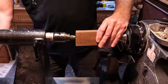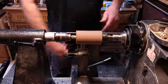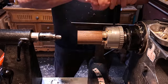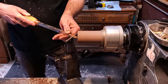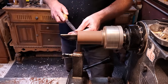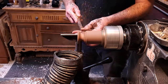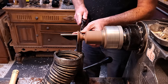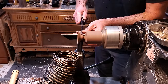I'm going to do the hats now and they don't look the same so I'll do them individually. It's a piece of walnut — just got it trued up, put it in the chuck, and I'll make both hats out of this same piece. The camera is on a tripod at this point because Robin is sensitive to walnut so I'm out in the shop by myself — sorry about the angles. This is going to be her hat, so I got the underside cupped out for the head, and I'm just shaping the top of it. Once that's done I ran through all the grits and then parted it off.